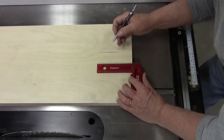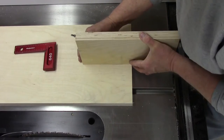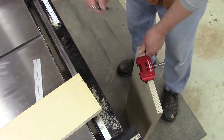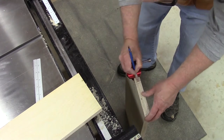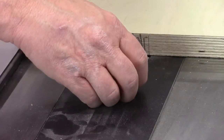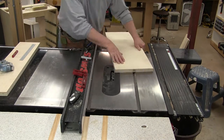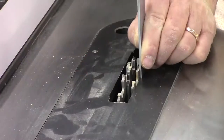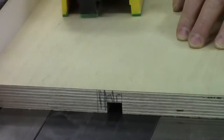Waiting for the saw to stop each time. We're going to set the dado position now on the back of this board — where the dado is going to be cut in. We're going to trace that around with our Woodpecker saddle square so I know where to cut this dado in there, and line the saw up on the marks. Check the depth — half inch — we're good. So we're just going to do a complete dado cut here.